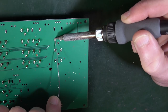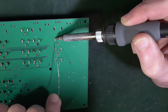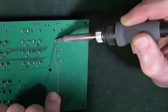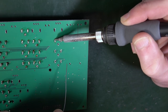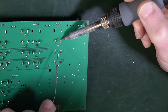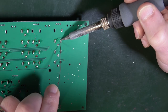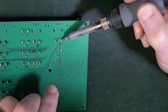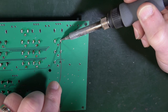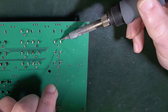Yeah, because at the moment it's not melting, which means that the whole thing is not quite hot enough. But once it starts to melt, if you just get to the edge where the soldering iron is, it'll then all start to melt and start to flow in there. Do you see that? And now it's full. You can see that there's solder all the way through that joint. I'll do it again on this one. So I'm holding on. It's heating up. Now, it may be hot enough that it will start melting here, but the probability is that you'll have to stick the solder further in that hole towards the end of the iron. If you get some on it, that's all right. Don't worry about it. And then that fills up.